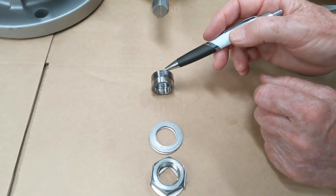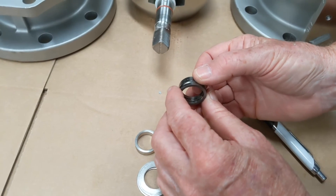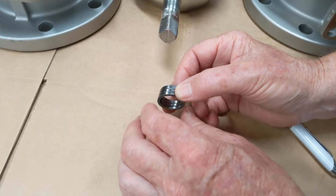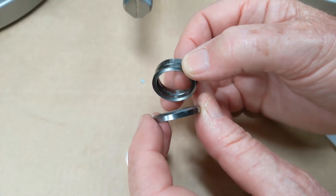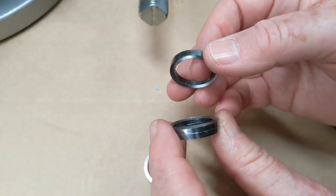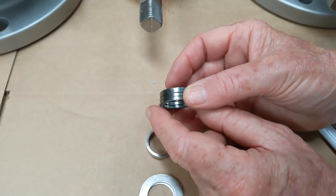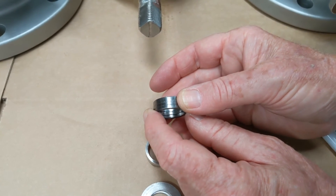The thrust comes from the Belville washers through a slider and onto the Chevron graphite washers. The Chevron washers are CNC machined — they have a cone face on one side and a recess on the other, so the cone face nests into the recess of the adjacent washer. This assembly sits against the internal face of the stem, and any compression of the crush washers forces the Chevron out to seal both the internal and external parts of the shaft.